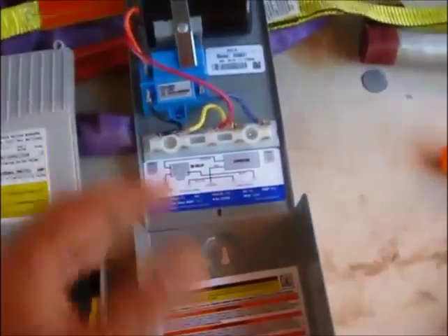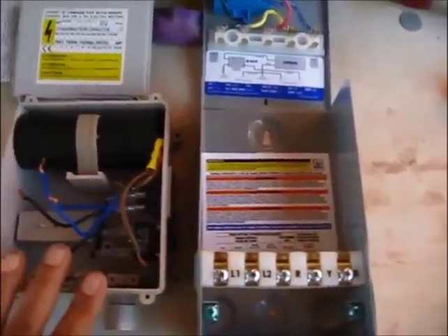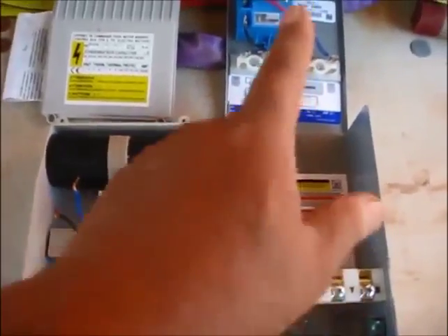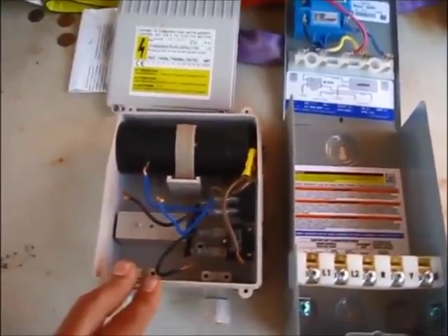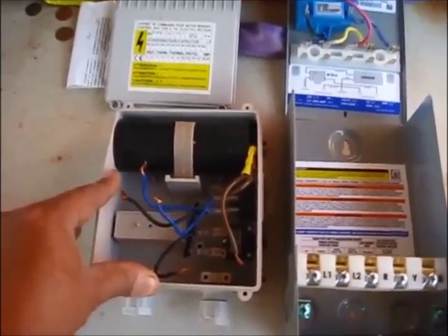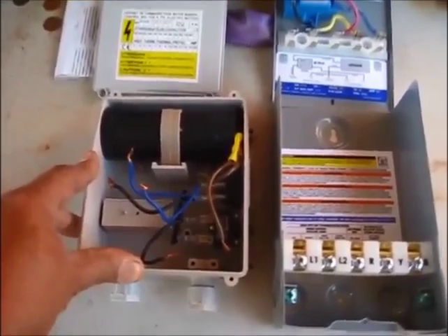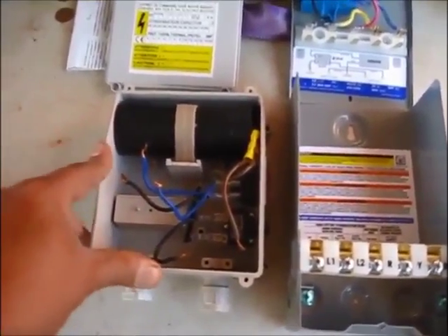There's no switch in this box because it's a quick disconnect — as soon as you open the box it disconnects from the power and the pump. The only difference between this box and this box, besides the cheap plastic, is the lack of a relay in here to switch the capacitor over to power, which I believe has to be inside the motor of the pump itself. Absent that, it can't operate properly.